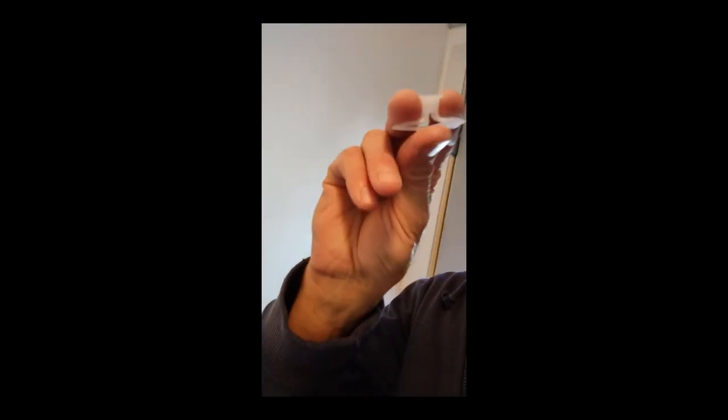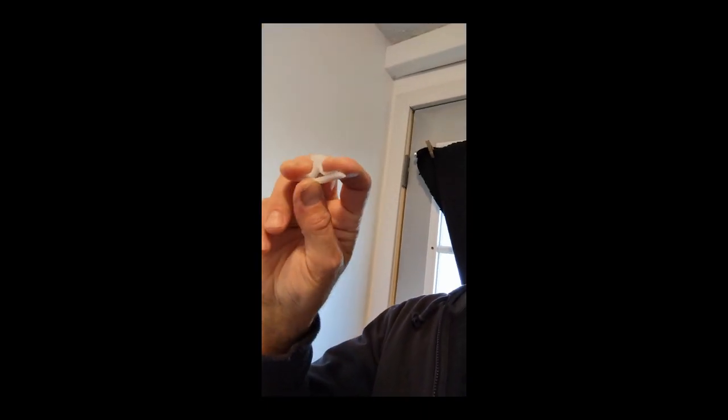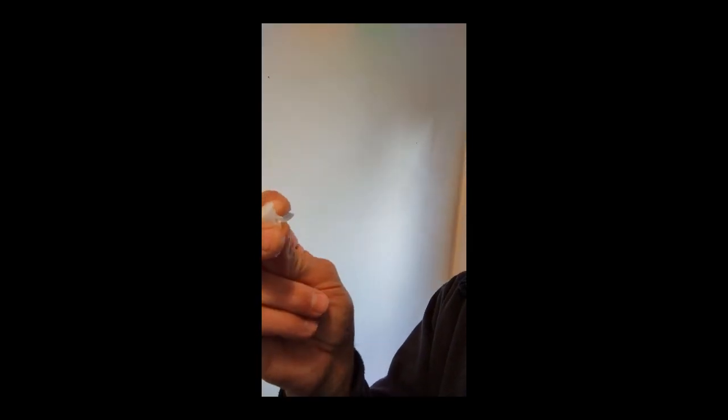A lot of times people use these little wall anchors for drywall. These work great for very lightweight things, but they don't work great for something that's going to have a lot of force on it, especially if it's not going into a stud. So I've got these other wall anchors, these little toggle anchors right here, which can support up to 50 pounds. Sometimes they can go up to 80 pounds per anchor. Although this is a little overkill for what I'm doing, it's not a bad idea to give that extra strength.